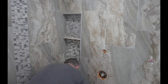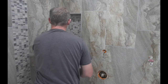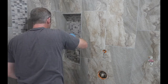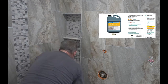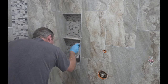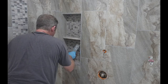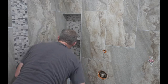Niches are a little bit painful. This specific mosaic has some stone in it — it would have helped tremendously if I would have sealed it the night before installing it, because that would help the grout from sticking to the actual stone pieces. Glass is usually pretty easy to remove grout from, but some of these travertines are a little bit porous and take more scrubbing.